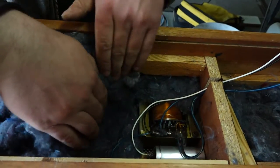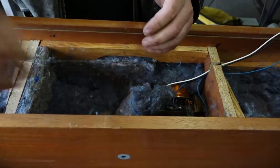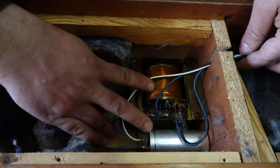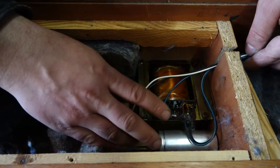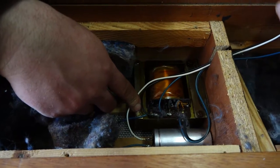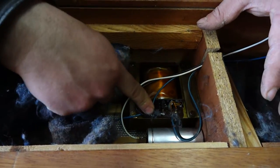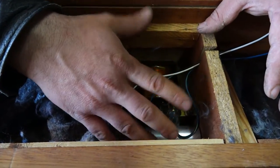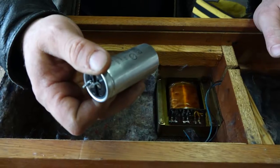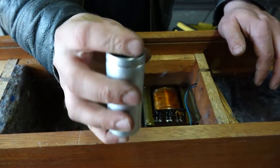So here somewhere is the magic with the washing machine capacitor. Oh. So this is how they solved in the past how to transfer the audio over a, let's say, relatively big distance. They used a transformer in an amplifier to transform the sound level to high voltage, low current, and then it arrived to here. And from that, this transformer did a back transforming, so low voltage, high current, with a washing machine capacitor. Guys, this is 8 microfarad, but on 250 volt AC, it's unbelievable.